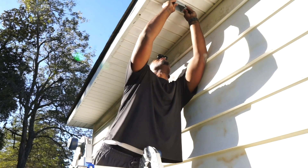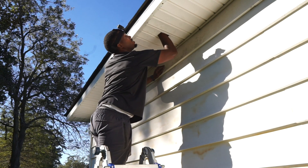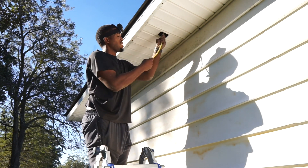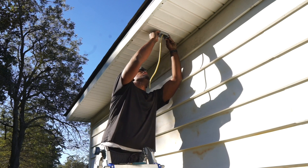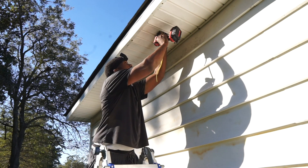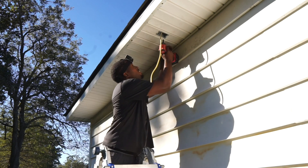Now we got our hole out. I'm putting in my pop-in box just to make sure everything is fitting right. The tough part is going in and trying to find the wire — I got my measurements correct so it wasn't too far. Once I found it, I put it through my pop-in box and started screwing everything in. With these pop-in boxes, they have little tabs at the top and bottom. Once you start to screw, it'll just suck down to whatever you have it in. Be careful if you're using an impact so you don't strip out your screws.